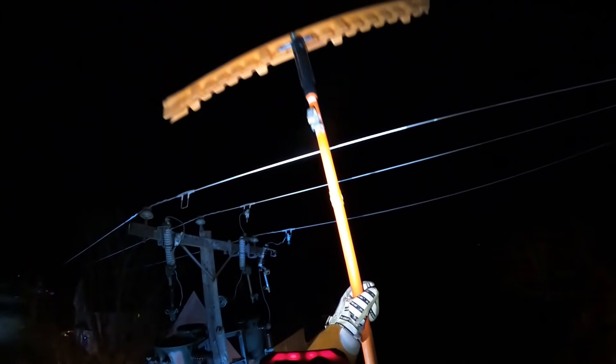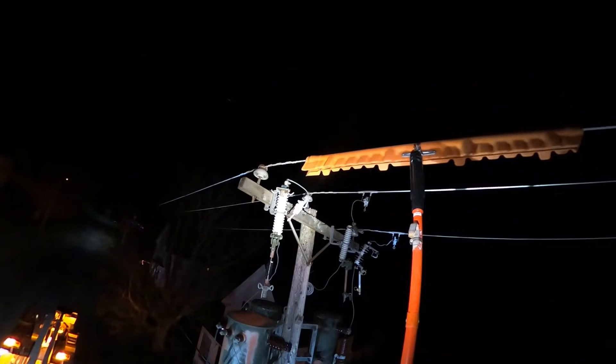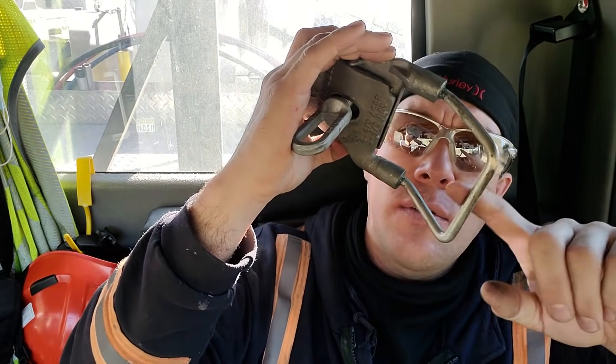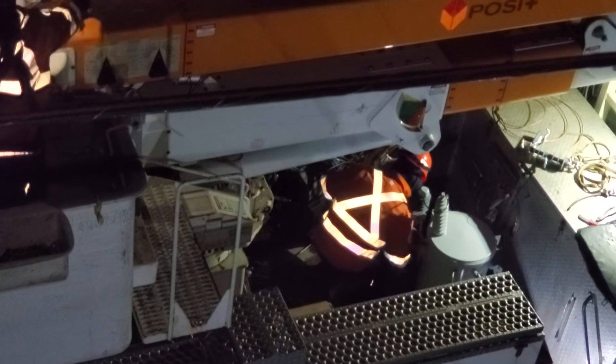Usually what I'll do in most cases is keep my 20 kV gloves on. The only thing I'm actually going to handle is the top-side lead of the cutout — we're going to back that nut off, pop it off the lead, put a new one on. That's it — pretty simple and easy job. In some situations where the cutout is extremely close to the primary — some older standards, older construction — you can install a hard cover and cover up that primary. That way you get some extra protection while working, especially at night. You're also going to want to inspect the condition of the stirrup while you're there to make sure it's going to make a good connection. You can actually put a brush on the end of your grab-all or hot stick and give that a good brush before you put things back together.